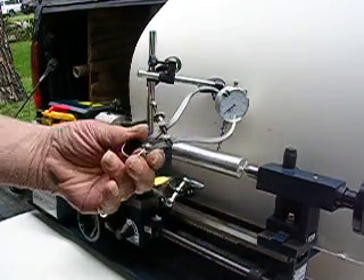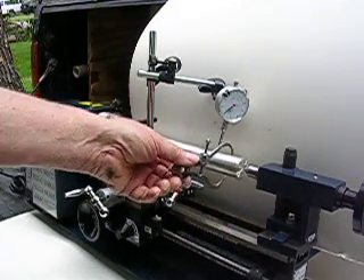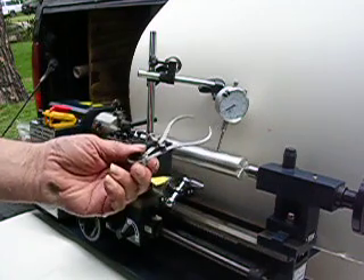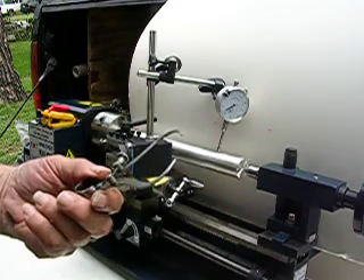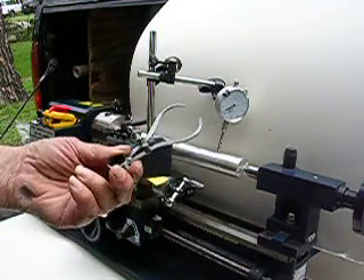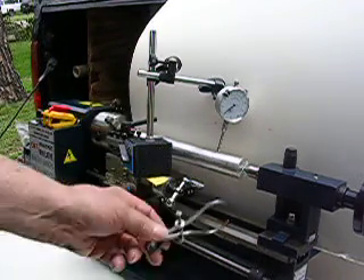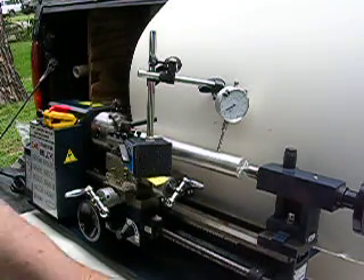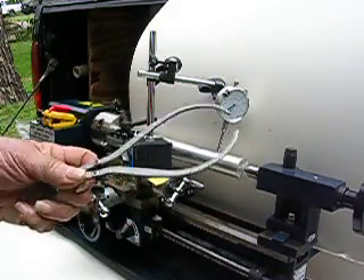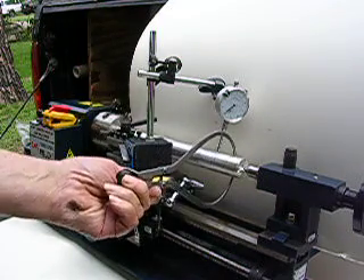Now these are dividers. That's a four-inch divider. I use them every time I use a lathe, whether it's a wood lathe or a metal cutting lathe. You can check your turning every once in a while. When you get down close to what you want, then you can use your mics — you don't need to use mics every time. This is a four-inch right here; you might want one a little bit larger. This is a six-inch, but it does the same thing, just a little bit larger.